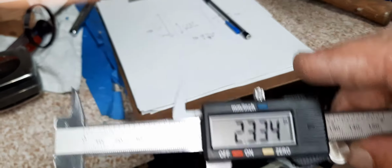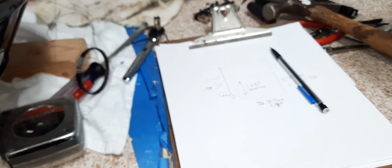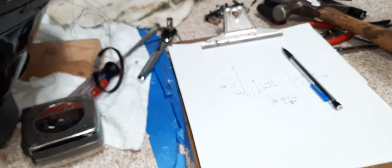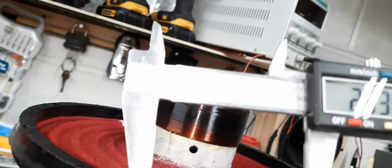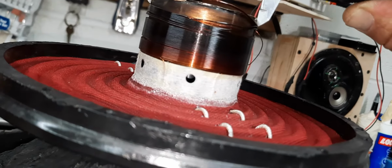Okay, inner diameter. We'll do inches. I'm doing both because you'll see in the book, it'll have it in millimeters sometimes or in inches sometimes. So just do them both. But to show you, I'm just doing this. So outer diameter. You did the top two teeth for the inner diameter. These bottom two teeth are for outer diameter.